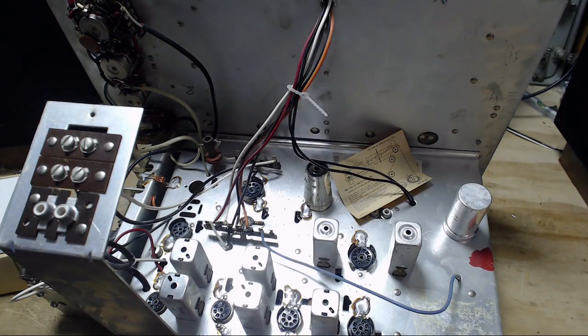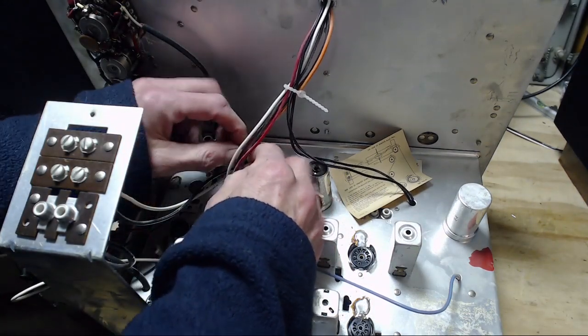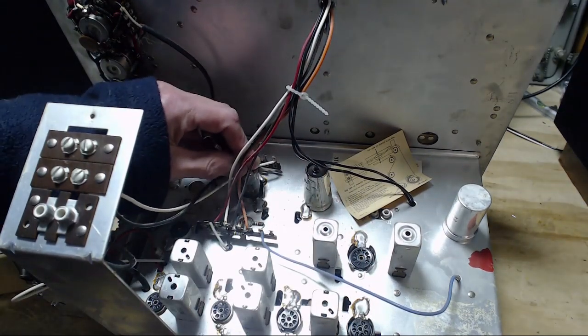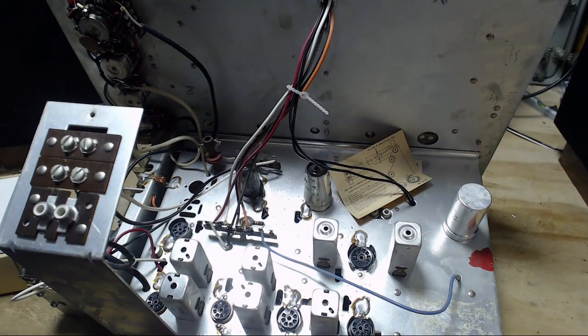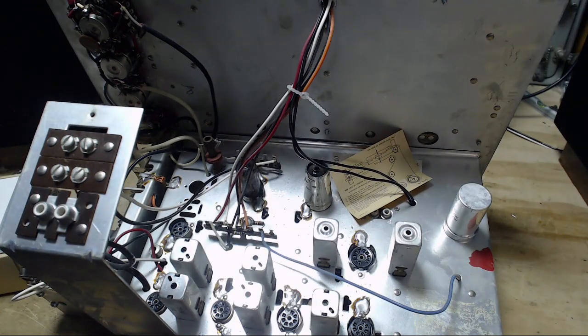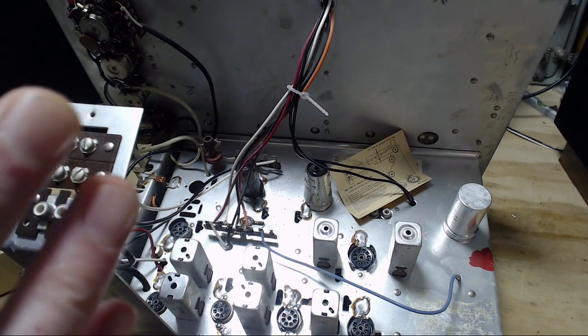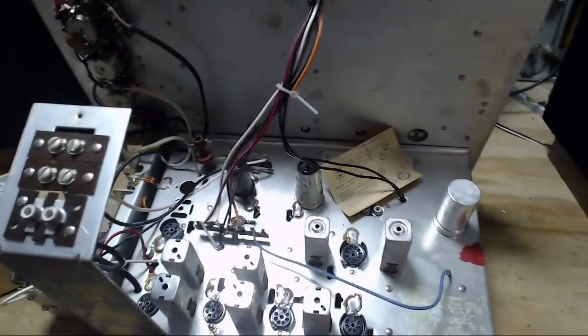Okay, the 12AT7 tests pretty good on one half of the tube. The other half is okay. So we can at least experiment with this. This should provide what we need. So I think that's all we probably need in here, these two tubes, the rest can be empty. They're all radio tubes, I'm pretty sure. And so we just need to make the connections between the amplifier and the receiver here, which I have not done yet, which I will do next.